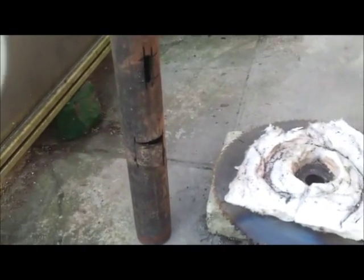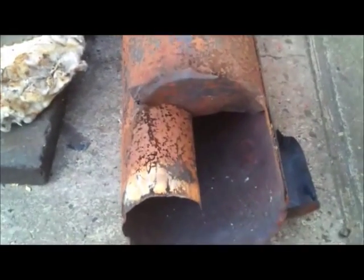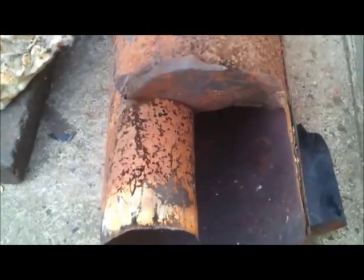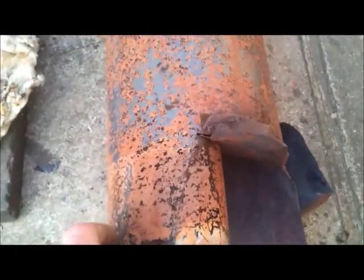This is an experiment for a new riser tube on a rocket stove, trying to create a vortex inside the internal burner. The bottom of the tube has been cut so it forces air into a spiral inside, with a small plate on top so air can't go straight up - it has to enter and spiral round.